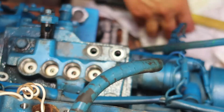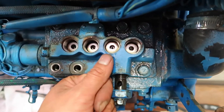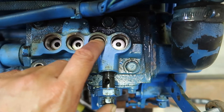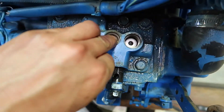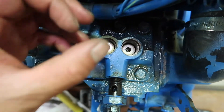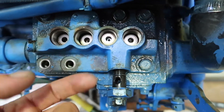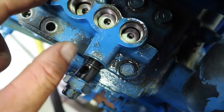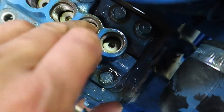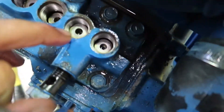So what I've done is turned it so that the piston has pushed up, but that's pushed the whole sleeve up. See how if I try to push that down it doesn't really want to go back down — it means there's a bit of a bind between the little piston and that big sleeve on the outside. So what I've been doing is trying to remove that bind, and then hopefully the pump will start working again. This is the last one — all the rest are all cleaned. This is the last one where even though that piston is up, I can't push this sleeve down very easily. So all I'm going to do is tap it with a punch — tap, tap, tap — and then that will end up being down.